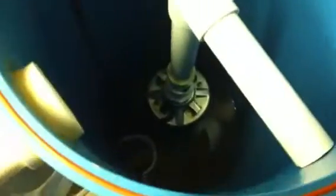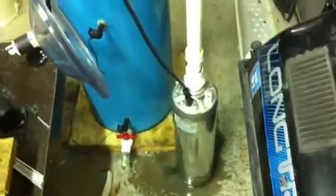Let's take a look at the pump here. I'm going to pop the cover off. What I have here is a stainless steel sump pump. To take it out I have a one inch T here — this piece right here is not glued in, so I want to be able to take the pump out nice and easy. We just reach down in there, pull that out, grab hold of the top T, wiggle it just a little bit, and now I've got the pump freed out. I'll pull the pump straight out and get a good look at it. I got water in there because I just got done testing the pump.